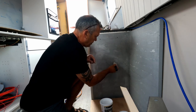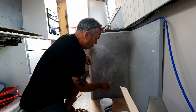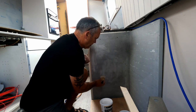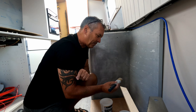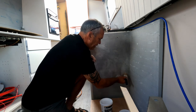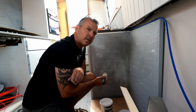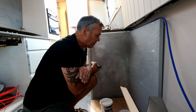Here we are on day two, nicely rested. I've managed to finish all the mitering to put the wood surround around the hearth — I think I've made a half-decent job, but I've also got a massive tube of wood filler. At the moment I'm just putting PVA on the silicate board so that the tiles have something to stick to and it doesn't absorb all the moisture from the adhesive, causing the tiles to drop off. I'm going to give this a coat of PVA.